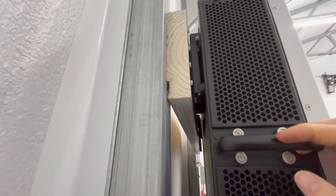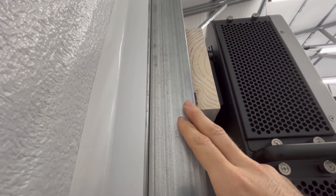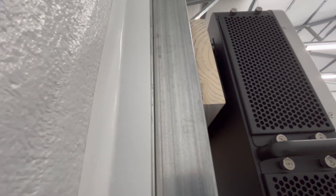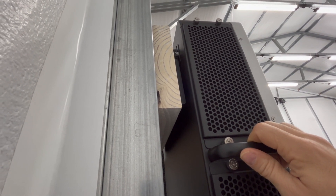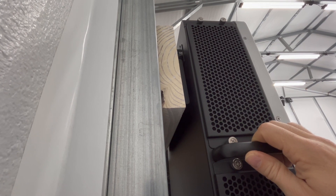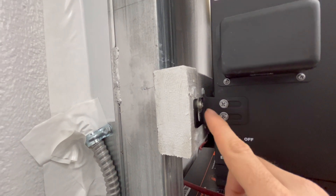As you can see on mine, I have it mounted here connected to a 2x8 that is up against my wall. I anchored the 2x8 into the steel frame of the shop, and then I mounted the bracket to that wood board. This is very heavy — about 104 pounds — so you want to make sure however you mount it is strong enough to hold that weight. Drywall is not going to hold it, but driving it into several studs would work. On the bottom, there are smaller brackets where I have a 2x4 connected against the frame of the shop, with two screws secured into the board.